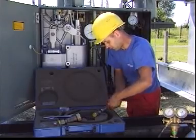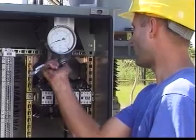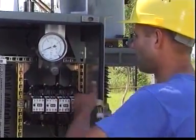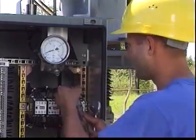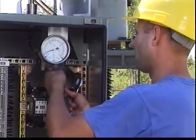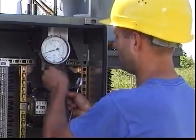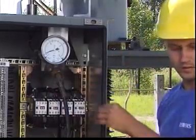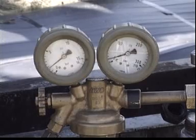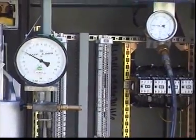Only specially qualified personnel are allowed to fill the breaker. The hose from the filling device is connected to the maintenance flange on the circuit breaker. Gas can now be poured in from the gas cylinder. The regulating valve on the cylinder fitting limits the gas flow to prevent the fittings from icing up. The filling process is continuously checked by keeping an eye on the precision pressure gauge. The rating plate shows you the nominal filling pressure for the gas compartment of the breaker.